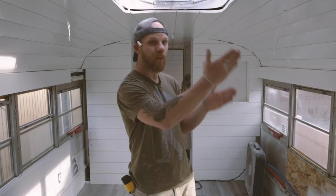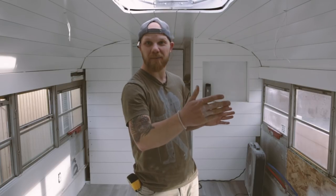And don't forget, if you're framing with 2x4s, this is one thing that I totally overlooked: every 2x4 takes an additional 3.5 inches. Imagine that. If you have 6 walls going this way, I didn't do the math before I started recording, but that's actually quite a bit of space that adds up with the wall width. I know a lot of people don't frame with 2x4s, I get that as well. I wanted to run electrical into those walls, so I didn't do just the particle board partitions that a lot of people do. We really wanted to frame it up and have the electrical running through the walls. So anyway, write it down on paper, map it out, start to get a really good idea of all of your measurements.